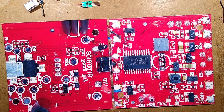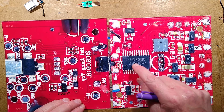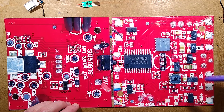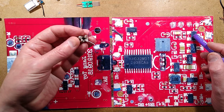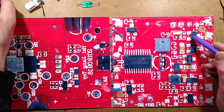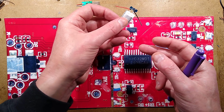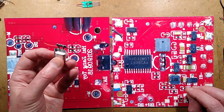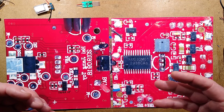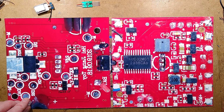It's mass produced with these anonymous chips — it's a bit of a party ender because we don't really know what these chips are. But it does at least show the basic operation and how everything is energy managed, and how these little motors are switched. It's quite amazing that these are such powerful little motors, and that these little MOSFETs are capable of driving them. I shall tape this back up and put a connector on it before I end up pushing it into a pile of stuff and causing a little lithium inferno on my bench. That's what's inside — it's extremely good value for money, simply because it is ultra mass produced. These circuit boards must be churned out by the bazillion. Well worth taking to bits.